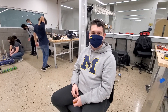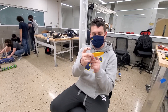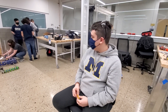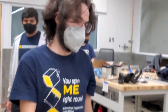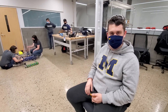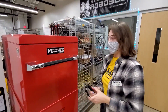It's about 6 PM on Sunday. Today we went through a couple of prototypes of the indexer design to get balls into the shooter. We're going to put this on a servo to flick up, but tried that and found it wanted to push the ball backwards, so we're doing two going like this instead. We've also modified the shooter to be wider so it can mount onto the wider bars in the chassis — it just works. The intake is getting mounted; they figured out where on the uprights to put it, attaching to a rung that's roughly 1.66 inches.